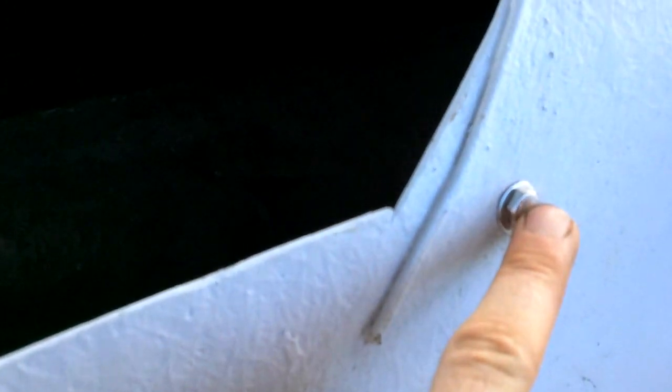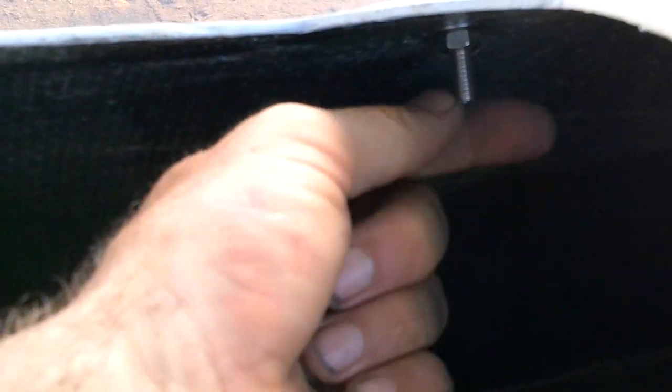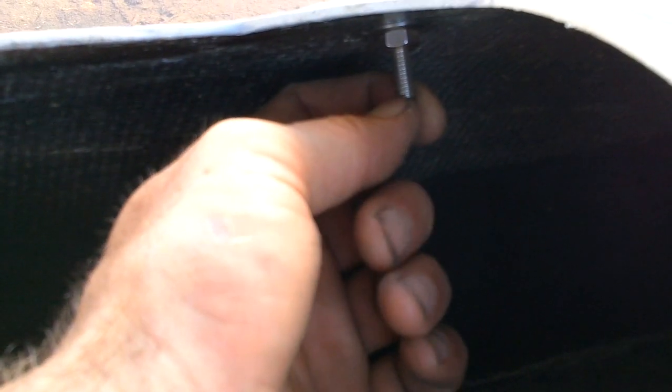All right, a pile of cables, some batteries. I'll go grab the other ones in a minute. In here, I attach two bolts, one here and one on the other side, and I'm going to make one of these positive and the other one negative. So I'll make all the positive connections from the batteries go to here, all the negative over there, and then I can make the positive from the charge controller come off here, and the positive to go to the motor controller, which I need to go grab.